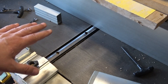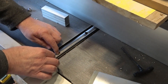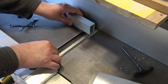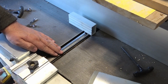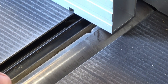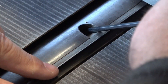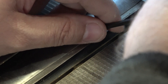The easiest way is to use some sort of indicator block. This aluminium one was provided by the manufacturer, but you can use a bit of aluminium or wood — just make sure it's very flat and smooth. The little slot in the bottom is four millimeters wide — actually 4.1 — or you can just make two lines on your makeshift block about that width apart. In use, you rotate the blade so that it's before its cutting position, then you align the first line or the side of the slot with the table edge, then you move the blade forward very, very slowly.